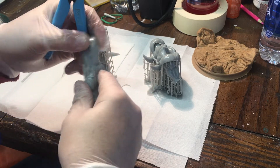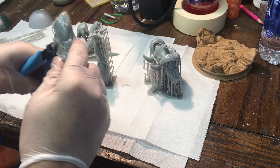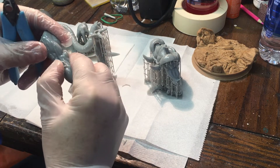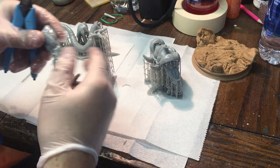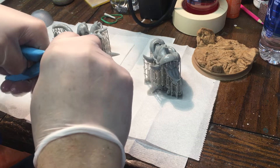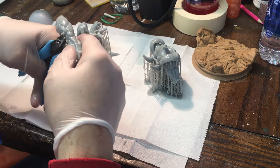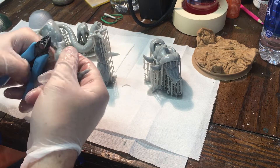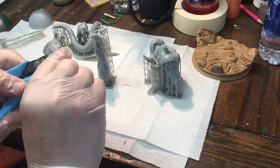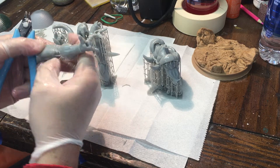Some of these supports can be a real pain and I try to orient my structure as much as possible to not have them tight up against the model, because they will leave a little bit of marring there and you're going to have to sand that off or grind it off. You risk the chance of actually putting a hole or crack in your model when you're cutting this up. So if you can, orient the supports so that they don't do this. I also had better support settings for Chitubox on my laptop, but my laptop hard drive died so sadly I did not document them.